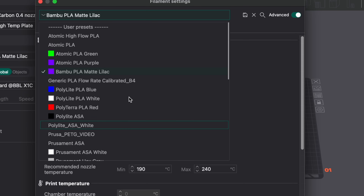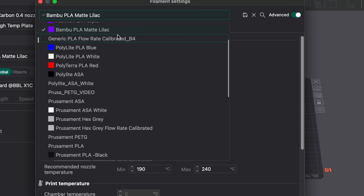Now, I can already hear some of the comments: you're using Bambu Labs filament on a Bambu Lab printer — just use the automatic calibration. It's meant for this, and it should turn out good. And I'm sure if I did, it would probably turn out great. But I personally really like to tune my own filaments, save them in a profile so I can reuse it over and over again. I don't need to run the auto-calibration, and especially for multicolor prints or quick prints, I can just send it with a filament profile that I've already saved. I also want to point out that if you have a P-Series, you don't have auto-calibration anyway, so don't think any of this is exclusive to the X1 — this is really what you should be doing on a P-Series anyway.